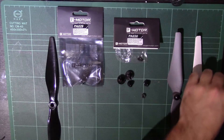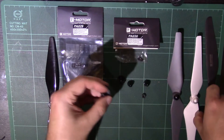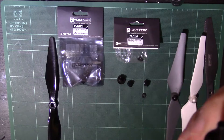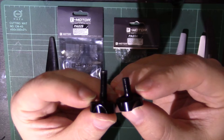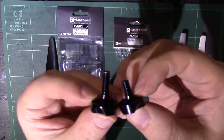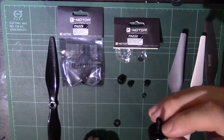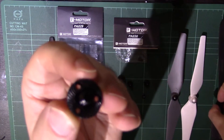So what you actually have to do — despite them not giving you any warning — is buy the PA004 and PA003 adapters. They are shorter versions of the originals. You can see the smooth surface at the bottom is much shorter, and the thread itself is also shorter. They're both M5 threads.